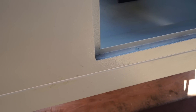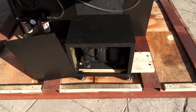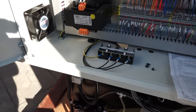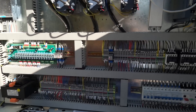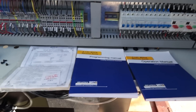The doors have been pre-drilled with a couple of holes — they must know about coolant leaks. My other machine didn't have that. Going around the back, I thought I might have got lucky and got a free rotary axis, but upon opening it, it's the transformer by the looks of things. This must be where the power connects. In Australia, all electrical work under the electrical act must be CE compliant — and you can see how neat everything is here. There's what looks like a VFD and Ethernet servo drivers. All the manuals are enclosed, and take a look at the size of that servo motor — it is a monster.